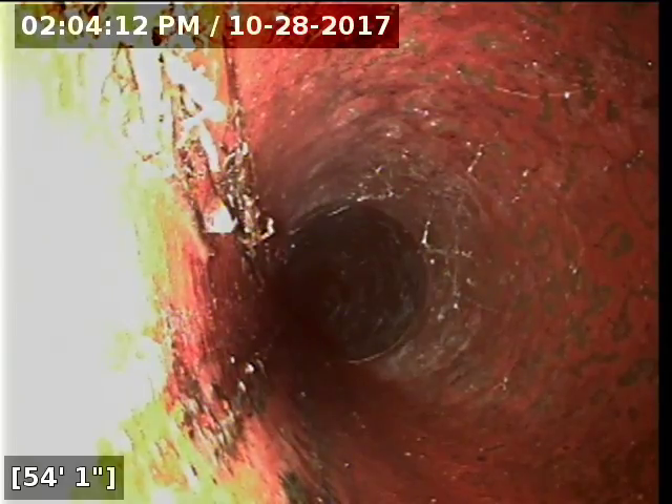Located the camera head successfully. I'm picking it up only about six inches before the sidewalk starts — it's in kind of a tricky spot. There are some bushes right there, so I have put some paint markings on. It's like a grassy-looking bush, around three and a half feet deep. I'm going to pull back a little further to find all the root intrusion. We'll get the whole section mapped out, but we do have root intrusions in every joint in between that spot so far.